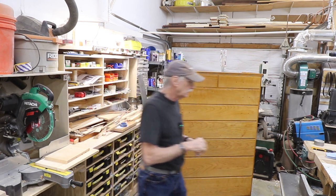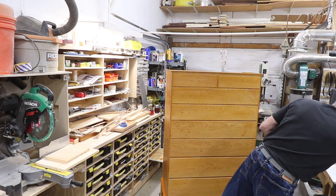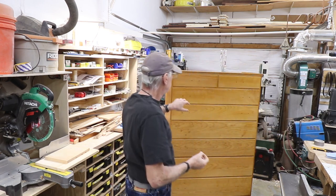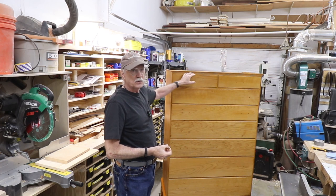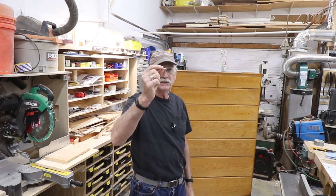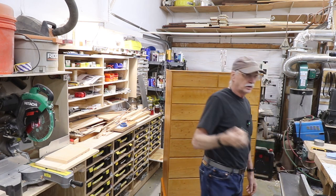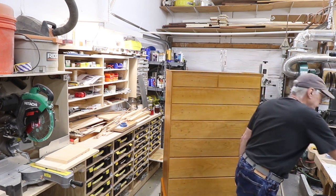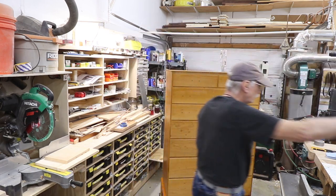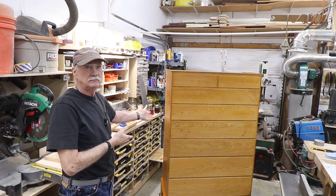Funny thing about the hardware. So I got the hardware in, and the screws, they're steel screws, cad-plated steel screws. They're kind of nice. But they're not designed for 3/4 inch stock like these drawers are made out of. So I have to nip off about 1/8 of an inch of every single one of these screws. Now I've got a cutter for screws, so I can do that. Or I could just order shorter screws, but I'll just cut these off. And of course, there's the bales. Typical 18th century Chippendale bales. Let me get to sanding and let's do some polyurethane.